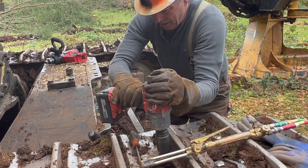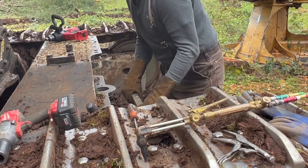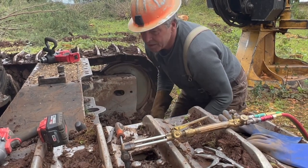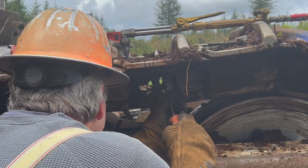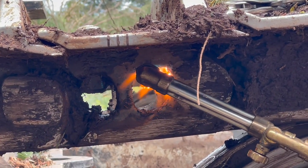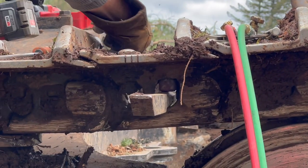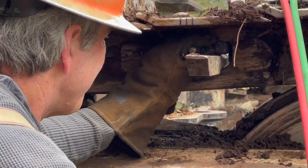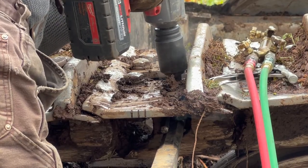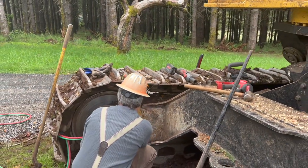Draw all those and heat it - as you can see, it works pretty slick. I opt to heat them and spin the bolts out rather than cutting them. There's always a chance you can compromise the integrity of the chain itself or the rail by cutting it. If you do it right, they really come out pretty easy. I like to do it this way.